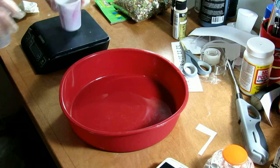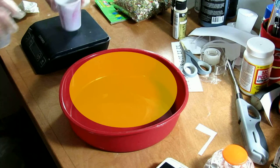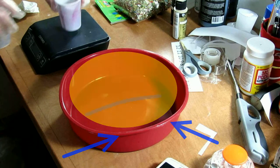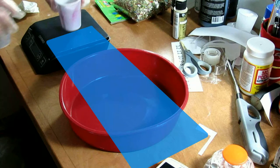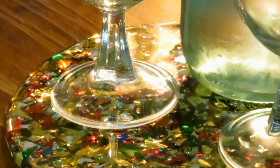Now, there were some mistakes made — a learning experience, I suppose. The mold was a bit warped, something I could have prevented. Leveling the mold beforehand would have helped, and laying a board across the top while it was curing could have prevented some of the warp in the final product. But I guess we'll learn from this mistake.